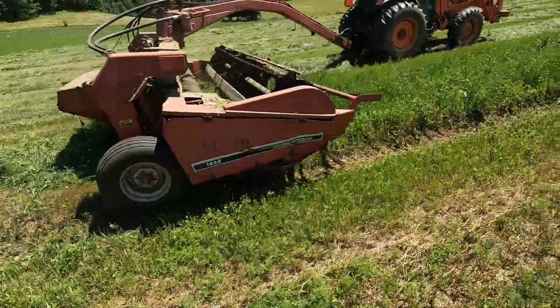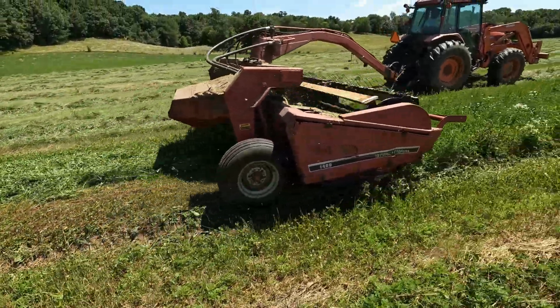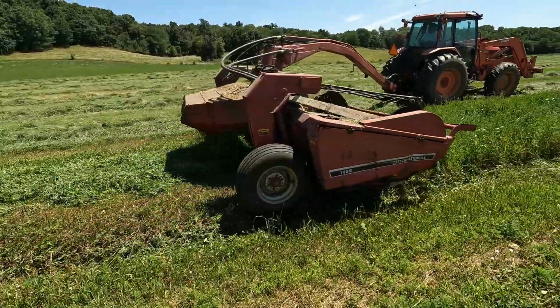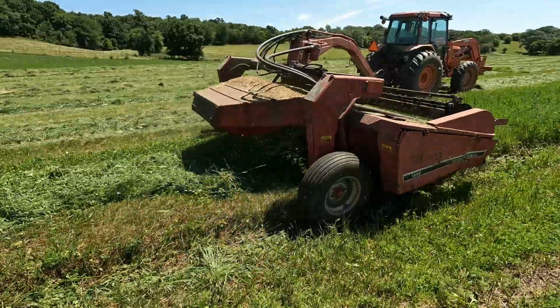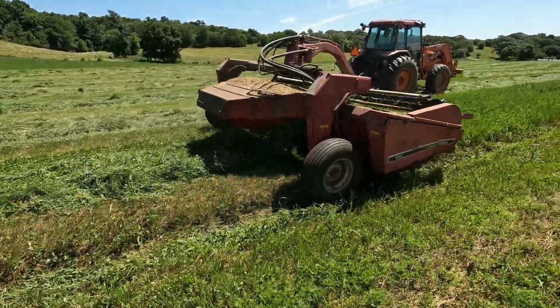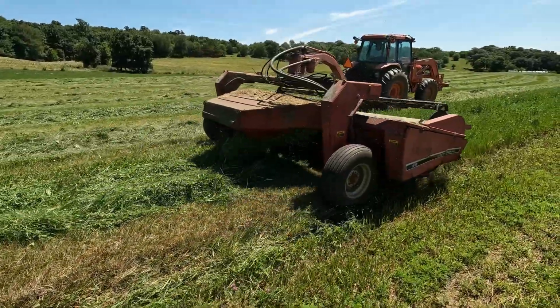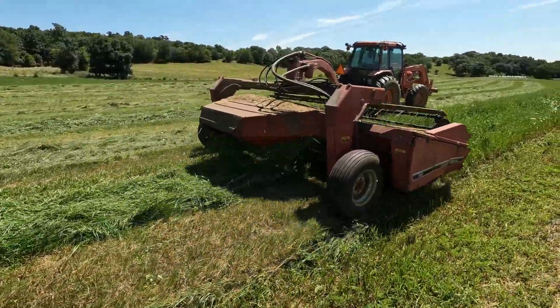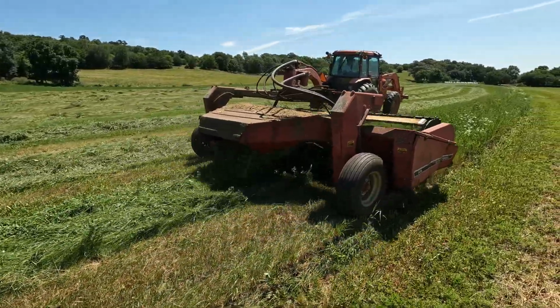Doing this section of the outside round must be a little more difficult. The field he is cutting is slightly higher than the one I'm walking in, and there's a little bit of a ridge in between from where the plow goes when we did this up, so his right haybine wheel is sitting a lot lower than the left one. So the haybine's sitting uneven on the ground, and he's still trying to get as much as he can.